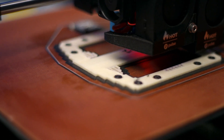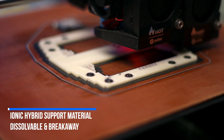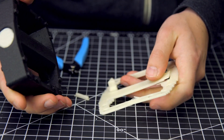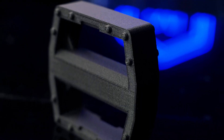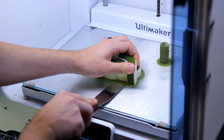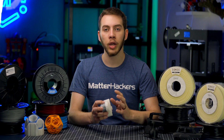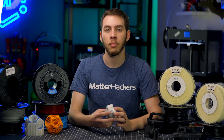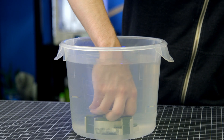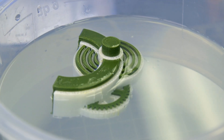Ionic is a hybrid support material because not only does it behave as a dissolvable, it also behaves as a breakaway support material. It can be removed from your finished 3D prints using regular tools as well. Before you set out to soak your finished 3D printed part to dissolve the support materials, you can break off some of the support to cut down on post-processing time. Then you can put this in tap water to dissolve away the rest in the hard-to-reach areas, or anywhere where the actual model is touching supports so you don't damage them with your removal tools.